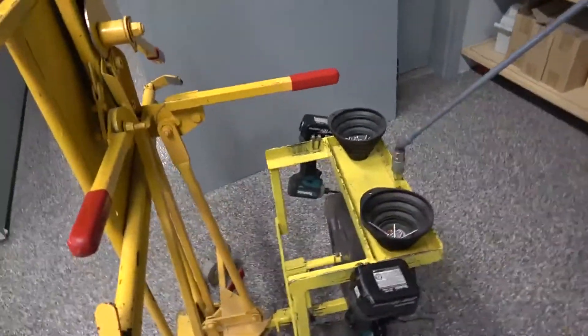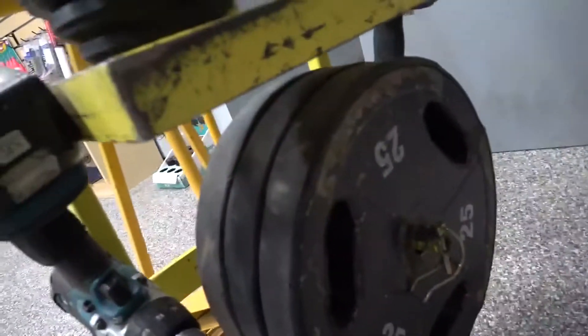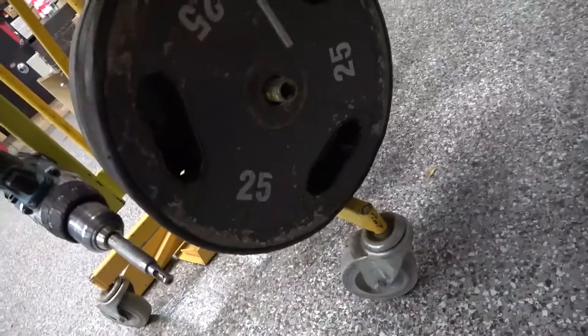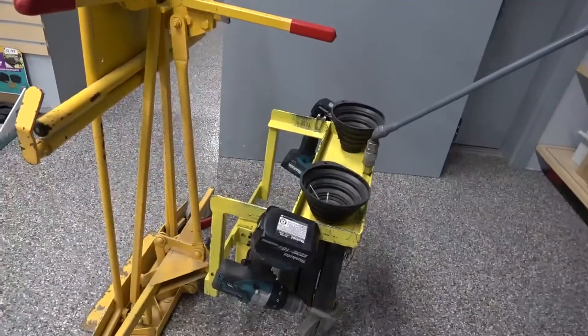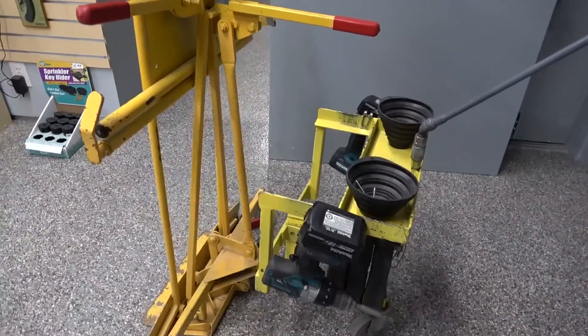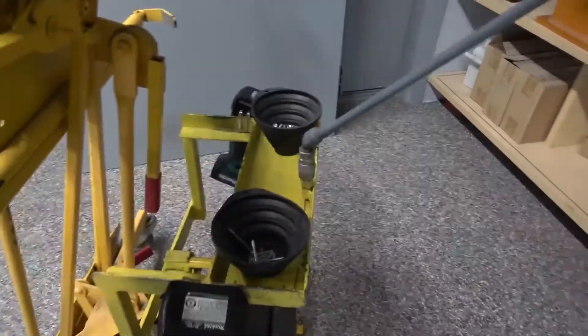Because I was working with heavy prison doors, the first modification I did was make a leg that holds 75 pounds of barbell weights. They come off very easily when I transport this in the truck — just a hitch pin, takes the three of them off, throw them in the back of the truck. Also I have a clip for this leg. When I stand the cart upright I can unclip this leg with no problem when the weights are detached. It allowed me to move across the construction site and jump cords without dumping these heavy doors. I could also move it in more ways than Telepro recommends — they say to only move it in line with a door on it, never travel forward or backwards. These counterbalance weights allowed me to do that very easily.